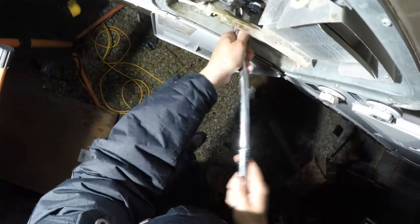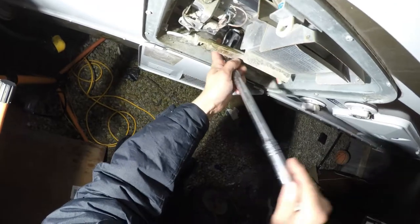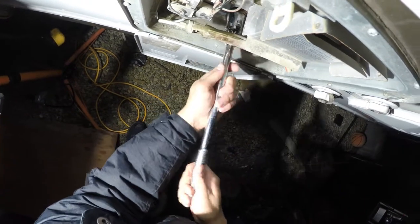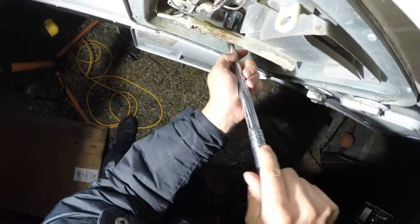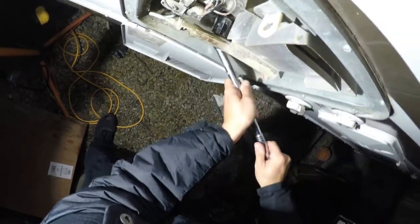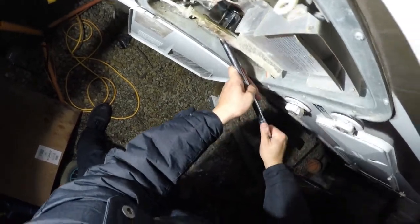Because this is drained and we're going to have it in layup for a little while, you want to make sure it's nice and tight — but not too tight, because if you want to check it later on, which you probably will, you don't want to have to use a pry bar. There's limited room in here because of the gas pipe right above where I'm working, so I only have about 30 degrees of play to tighten this thing.